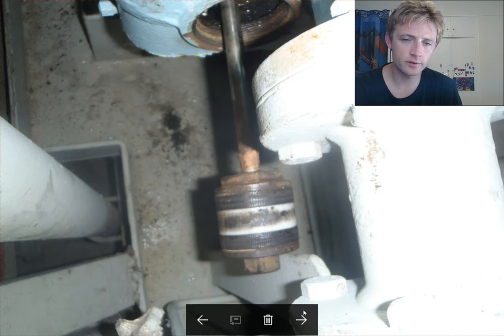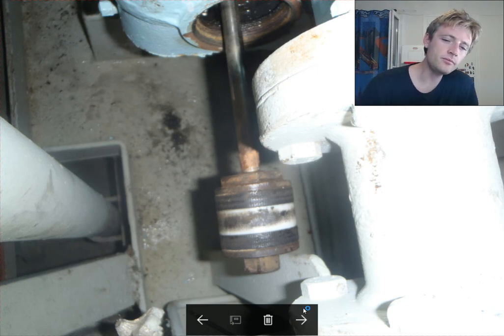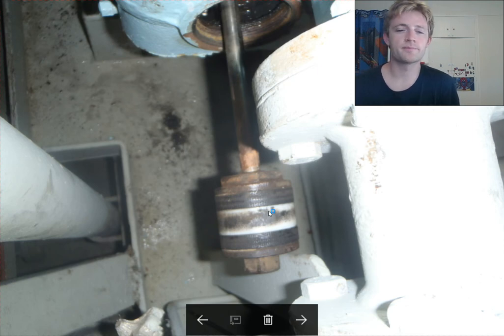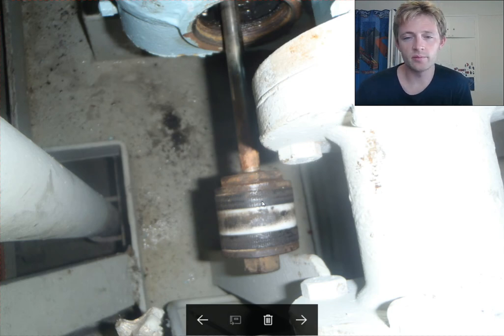Remember: do not run this kind of pump without liquid — always have suction. If for some reason you do not see suction on the suction side, there is no vacuum — stop the pump and call the third engineer or second engineer to see what is happening. The most common problem for this kind of pump is that the liquid is very hot, which damages the seals, and the pump can no longer transfer suction and discharge.